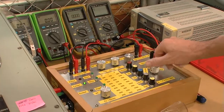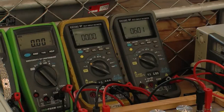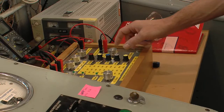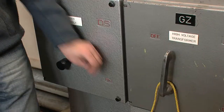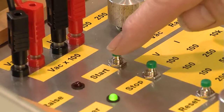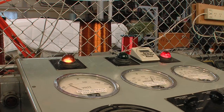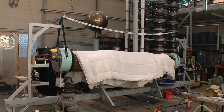There's a target for the total energy — how many kilowatt hours you want to go into the log — and then there's a readout at the end showing the actual amount of energy that's gone to the log. With this sort of power it's going to be of the order of 10 minutes. This is 100 kilowatts approximately; with a megawatt, it's going to be in the order of one minute.